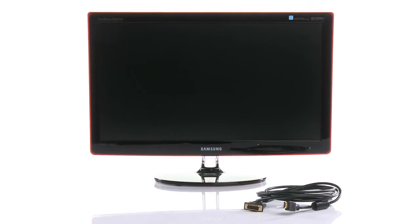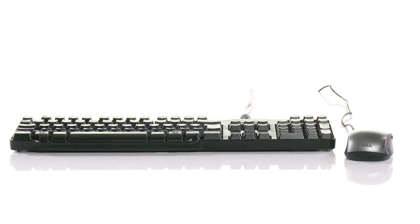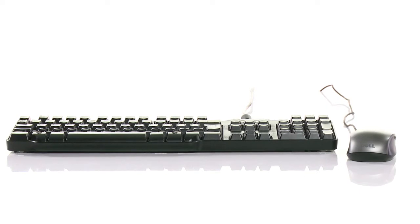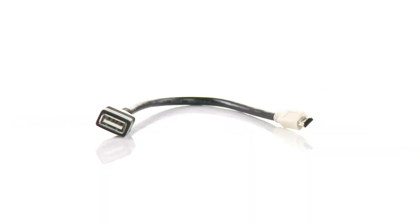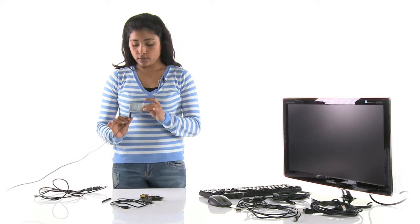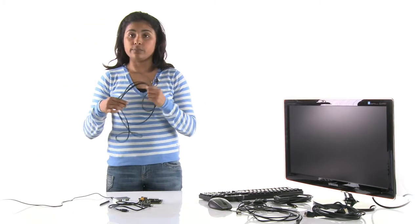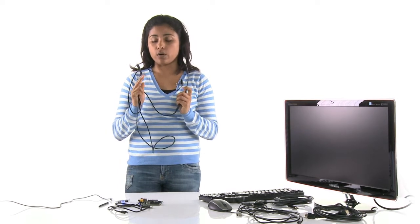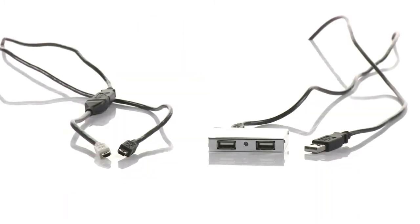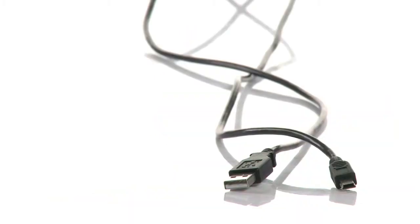The USB on the go port allows you to connect USB peripherals such as input devices like mouse and keyboard to the Snowball board. For a single device, you can use a USB Mini A to standard A adapter. Multiple devices can be attached through a USB hub, which is connected to the board with a Mini A to Mini B cable or with a Mini A to standard B cable, depending on which type of cable the hub requires. For a serial console access, a standard Mini B cable is used.